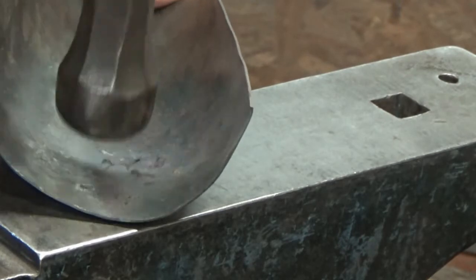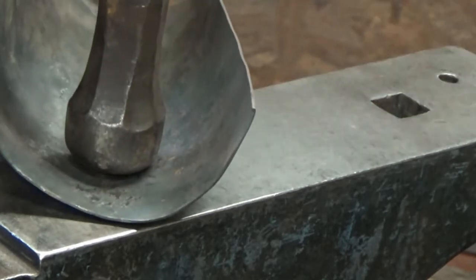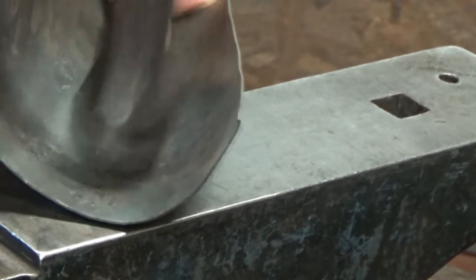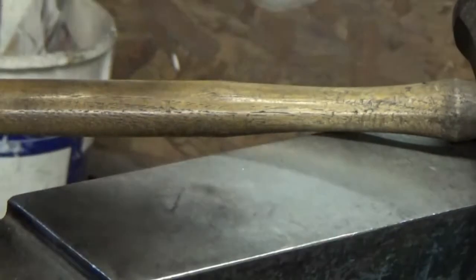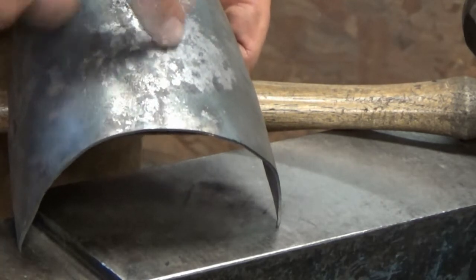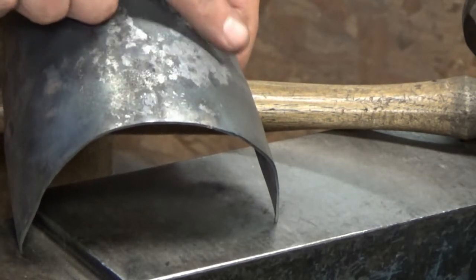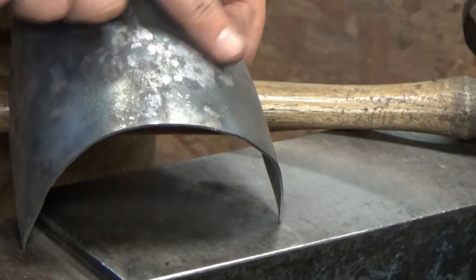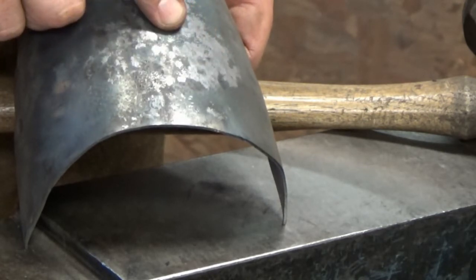If you find the piece jumping about in your hand it's because you're working away and off of the anvil face. That can be useful if you find a valley you need to push down — you can come just about a millimetre away from the anvil face — but generally you want to work straight down, moving the piece under the hammer. You can see it's starting to really smooth this material down. A higher carbon steel would start to work harder, so you have to be aware of that. For now it's coming on nice and smooth.